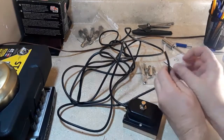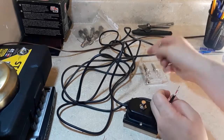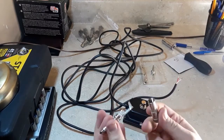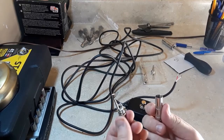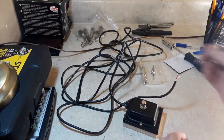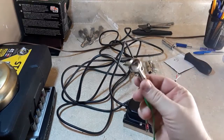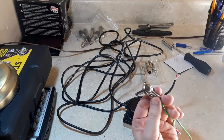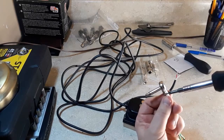For the other end, we're going to need some sort of plug — a quarter-inch plug. I've got some really nice Switchcraft-type connectors — actually, these are Switchcraft. They work really well when you've got a bad cable; if you stock these, you cut the foot off or so on the bad end, solder one of these on there and you're good to go for another couple years. They're really nice to have, but I really don't want to use one of these on this junky footswitch. So what I found was one of these — I think Fender used these, and to tell you the truth, I don't like them at all. They're really kind of old and clunky to use.